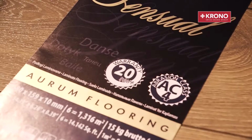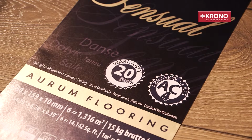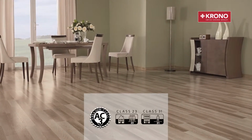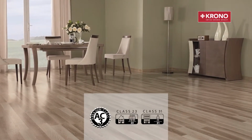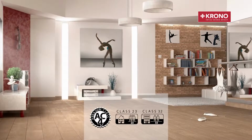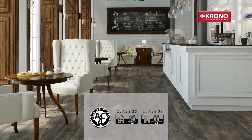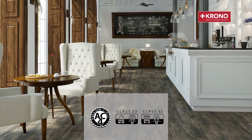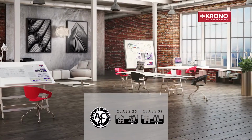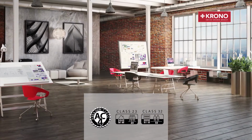Let's start with abrasion resistance rated as AC3, AC4 or AC5. AC3 rated flooring is suitable for residential buildings. AC4 rated flooring may be installed in all residential premises and in commercial spaces with moderate traffic, such as hotel rooms, offices, parlors, dining rooms and living spaces.